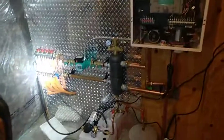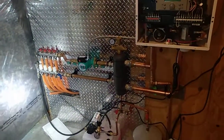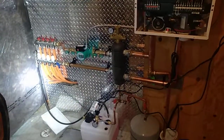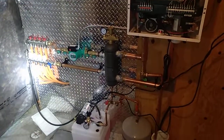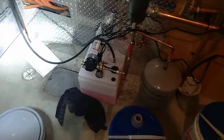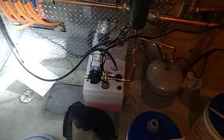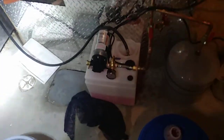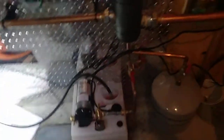All the plumbing for this simple snow melt is done and I'm filling up with the 50-50 solution of propylene glycol. The way I do it is with this little batch feeder — a glycol feeder that keeps the system topped up at all times. The initial filling is done through this feeder, which pushes glycol into the hydraulic separator through the bottom.